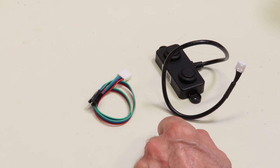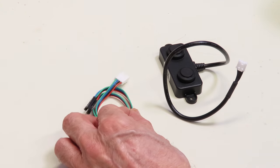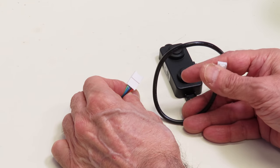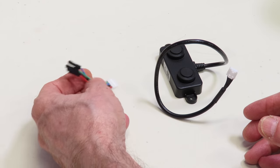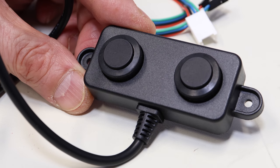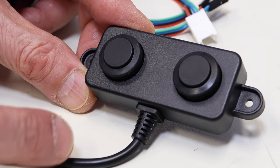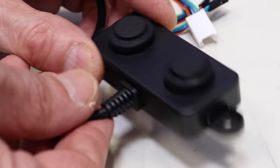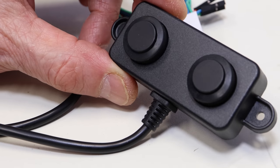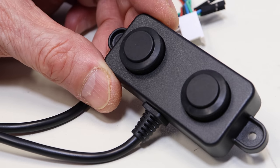Here's a quick look at the A02YYUW. I've got the sensor and an adapter cable — purchased from DFRobot under part number SEN0311. They included this adapter cable which converts the JST connector on the sensor to four separate wires for experimenting. The sensor itself is a completely sealed unit with a resemblance to the HCSR04, having separate transmit and receive transducers, along with two mounting holes on each end. The back is also completely sealed with a rubberized feel and a bit of weight to it. It feels like a very solid product — I'd feel quite comfortable mounting this outdoors or using it in my outdoor robot.